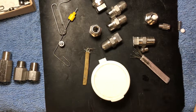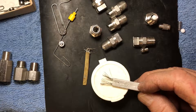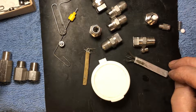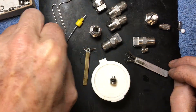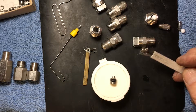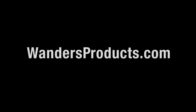So we've talked about a few things that can clog up on you — mostly jets. Get yourself a jet cleaning tool, use one strand to clean every jet you've got. Nozzle bushings, metering tips — these are the main things that clog up that are small and that you're going to need some help with. Hope this helped, thanks for watching.